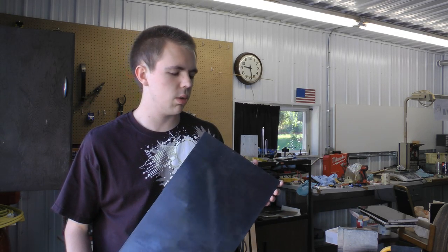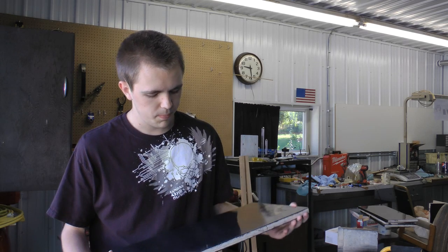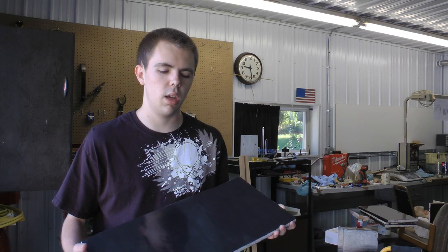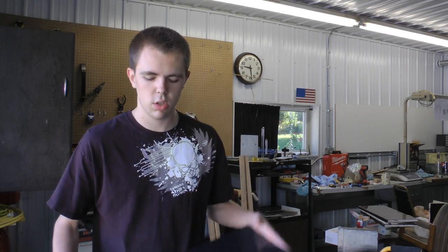What we've got here is three-quarter inch birch veneer plywood. I put three coats of Minwax water-based stain on it and two coats of water-based polyacrylic. I did two coats and then sanded with 320 grit on a random orbit sander, just lightly enough to take out the big bumps and get somewhat smooth, then went back and put a really thick third coat on it.